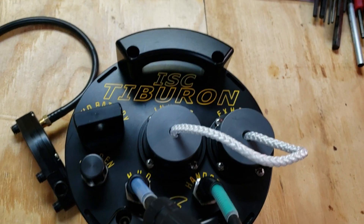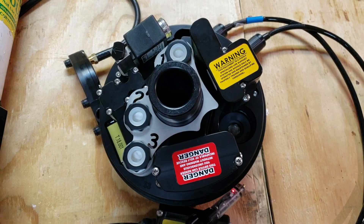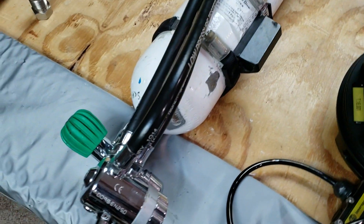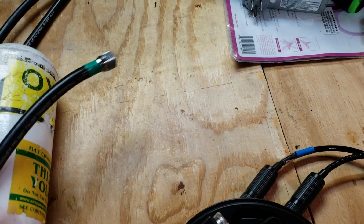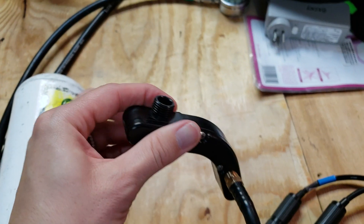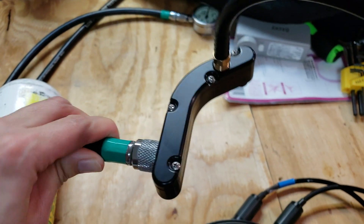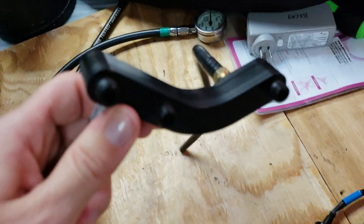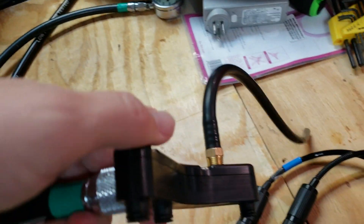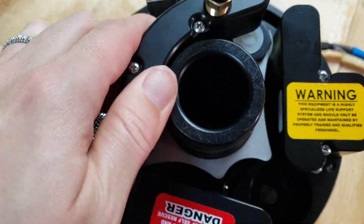To do the head calibration we're going to flip it over. Next, you need to have a tank of O2 with your regulator hooked up. You're going to use the low pressure hose that goes into your head, and that is going to screw right into the side of the calibration kit. On the bottom you can see you've got a couple of areas for your sensors — that's where the O2 is going to flow over your sensors, and this dangly piece is where the O2 comes out. So you're going to put this over your sensors.